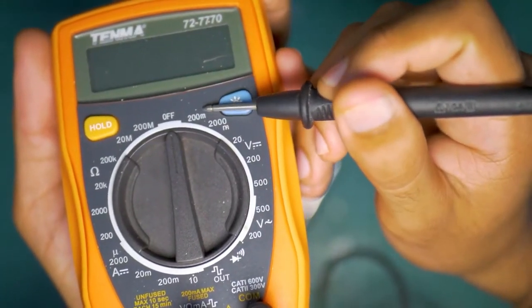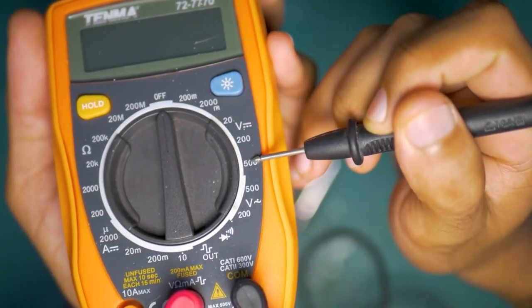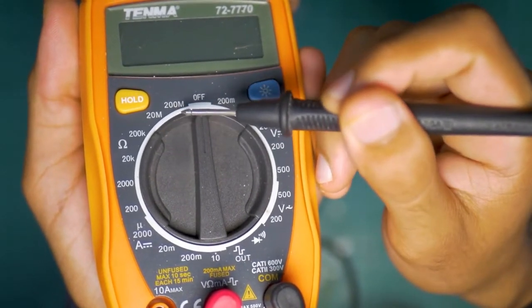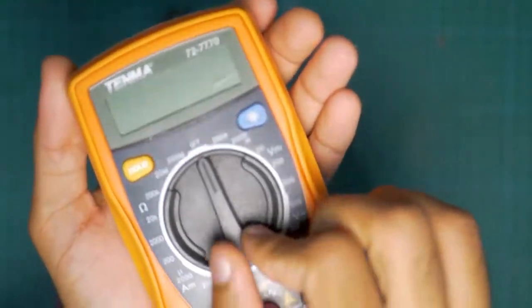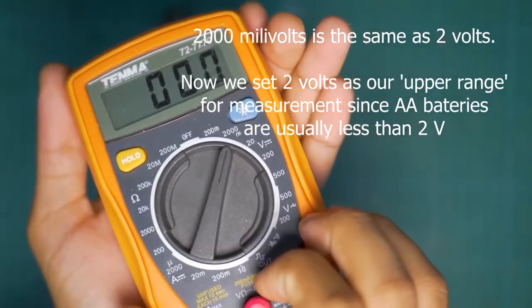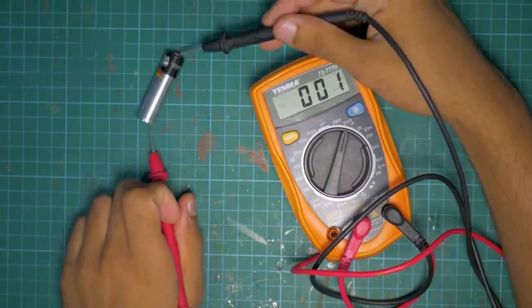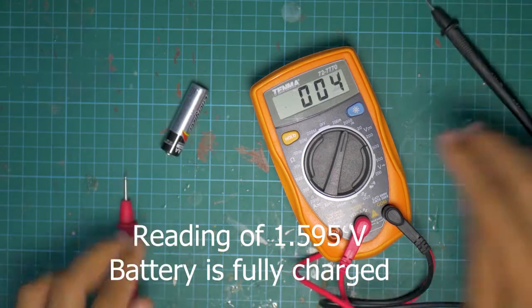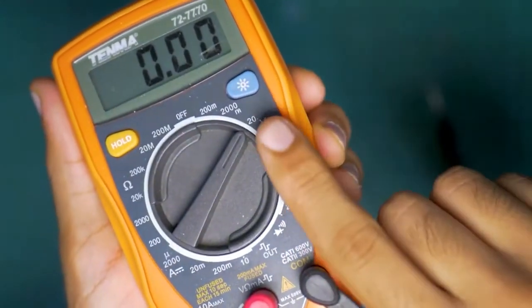You might be wondering, what are these different numbers? Within each range — so within voltage, within resistance measurement, and within amp measurement — you will see multiple different ranges. The reason is that these ranges give you better resolution, meaning better accuracy. For example, a battery is usually 1.5 volts, so you know it's going to be below 2 volts. If you select the 2-volt range, you're going to measure anything from 0 to 2 volts and get a very accurate measurement. You could alternatively measure it at 20 volts, but that won't be as accurate since it's measuring anything from 0 to 20 volts, so your accuracy tends to suffer.